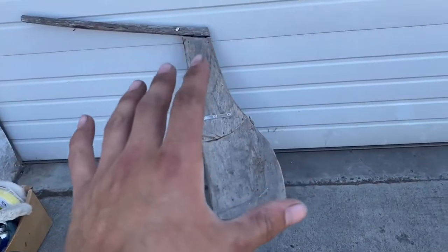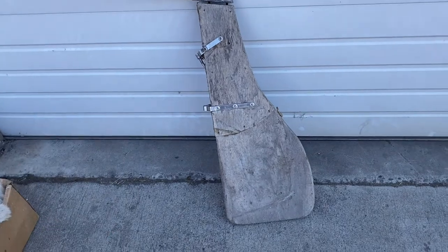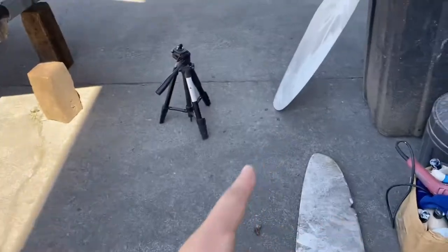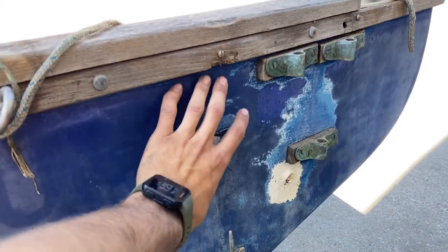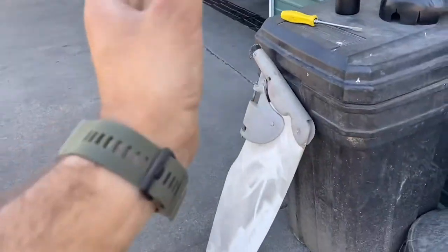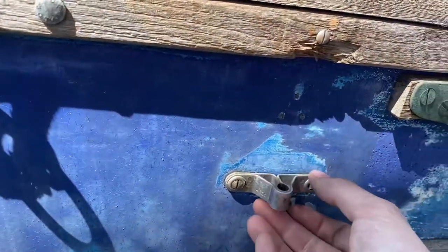The first project is going to be our rudder. This boat has always lacked rudder authority — really kind of sucked in that department. This rudder is a total loss. So we are going to fit this boat with the Hobie Cat 16 rudder. The only thing I'll have to do is move these mounts up about two inches — this thing will click right on there. It's going to be totally sweet because it will flip up, lock up — a lot more rudder authority, way more hydrodynamic.